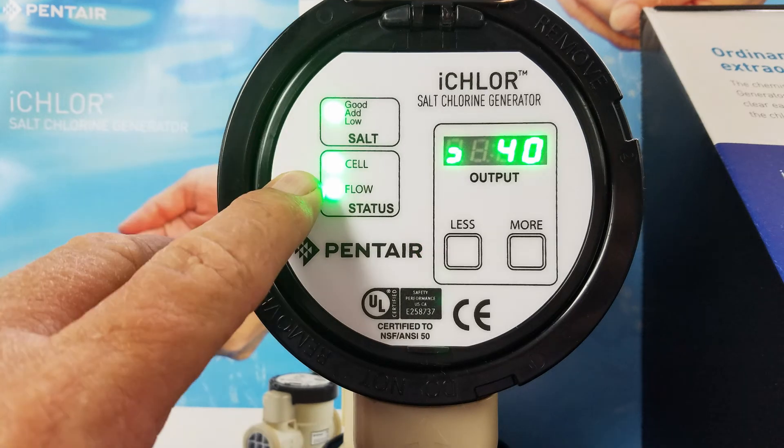This is a photograph of the status light. Green is good. Green flashing means inspect cell, and cell will appear in the display. Red solid means standby mode — the cell will be shut down because of cold water. Red flashing indicates a temp sensor error.